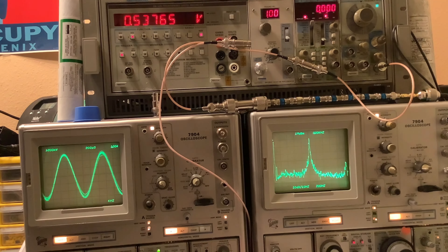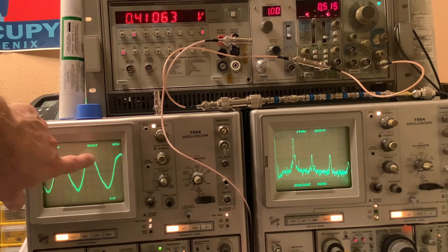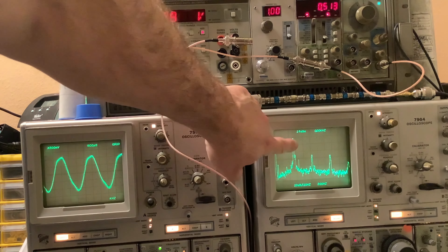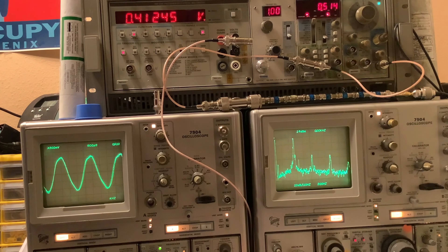What I'll do next is some frequency measurements. I wanted to get the 500 Hz spectrum, because it doesn't do so well at lower frequencies — you can see non-linearities and all the harmonic content. That's the primary, and these are the harmonics of it; it's just really quite nasty looking, but it is what it is at 500 Hz. So the next thing I'll do is a frequency response check, and I'm going to get my 3 dB down and my 6 dB down points.